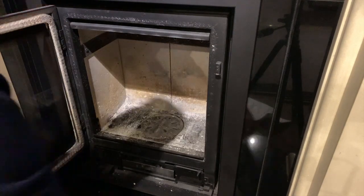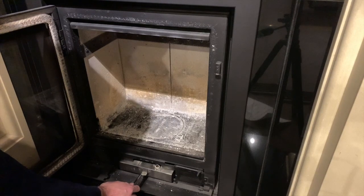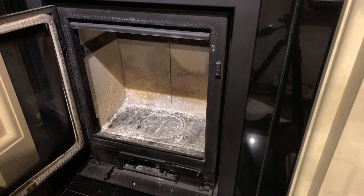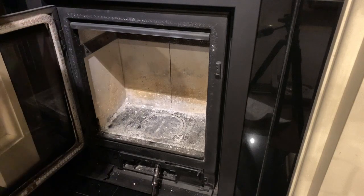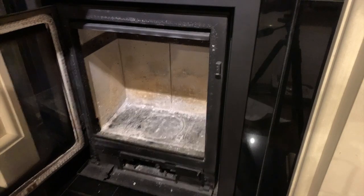My next tip is usually a great place to start if your fire is burning a lot more rapid with all air controls closed. As the grate mechanism is quite unique on the Riva multi-fuel stove, ash and debris can collect between the centre and the main grate of the fire, which will allow excessive air into the fire even if all air intakes are closed.